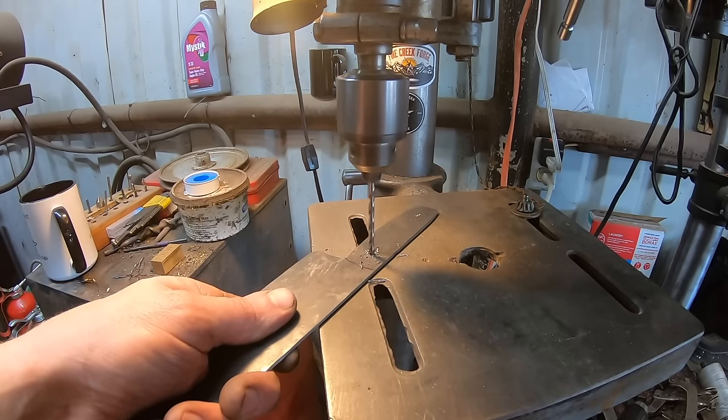All right, I'm not seeing any delams, anything like that. Maybe should have had it in the water for one more second. That's why I went ahead and cooled it off just a little more in the oil, so there wasn't any extra heat. Tempered up, grind this thing and see what happens.